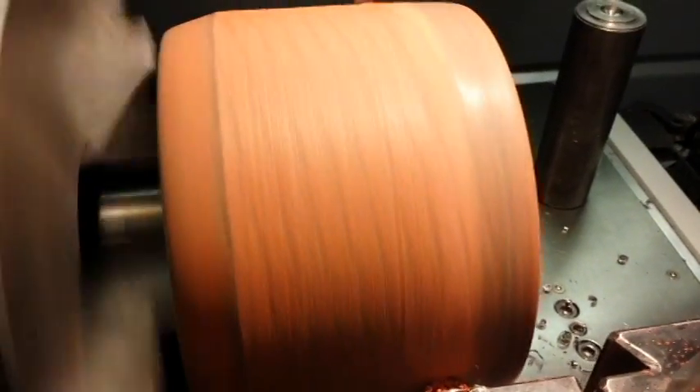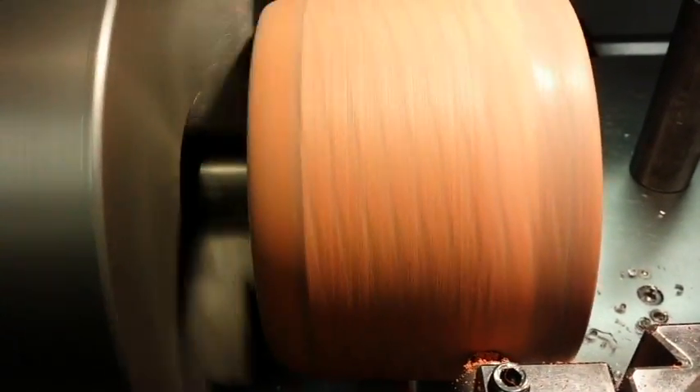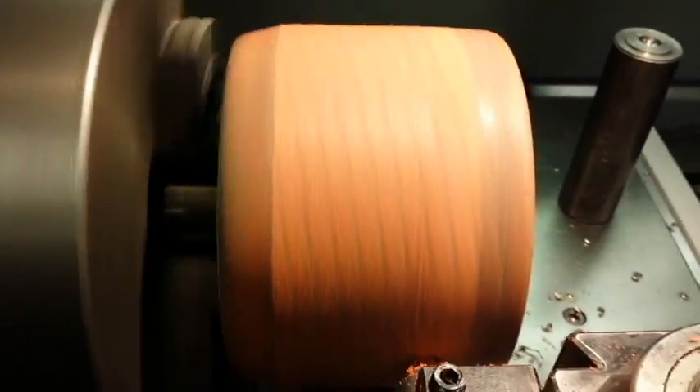I'm machining rubber. I couldn't believe I was able to do it, but with a little research I was able to find a few drawings from the patent office. I was finally able to make a little tool, and I'll show you how I did it — a tool that is designed to actually cut rubber. I've been cutting rubber and redoing a contact wheel. It's a serrated contact wheel. I'll finish my cut here and show you how I did it.